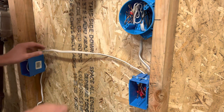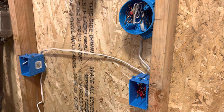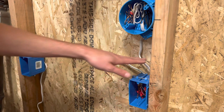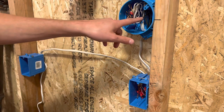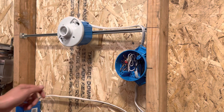And that's it. That's how you wire a three-way switch — two boxes for a three-way switch. You have your power, your three-wire, and then your switch leg. I'll show you guys in the next video how to hook up the switches, plug it in, and test it. I'll probably throw the other light in here for the next video, then plug in some light bulbs and show you guys how it all works — how to check if it's wrong and all that stuff.